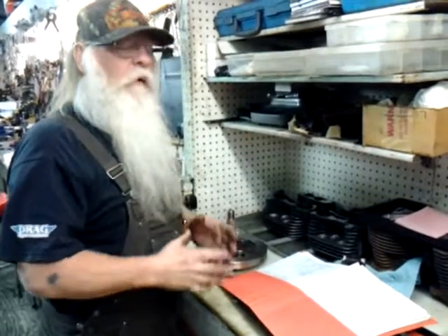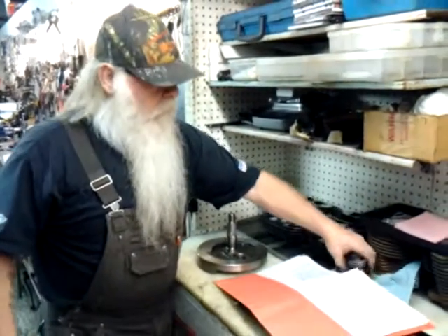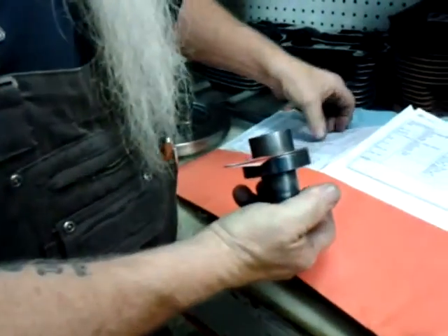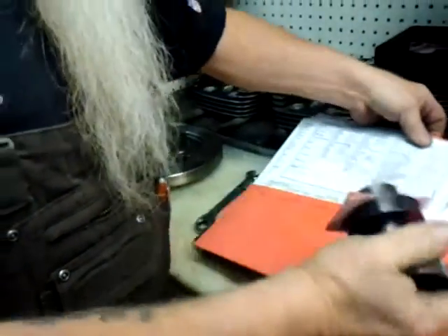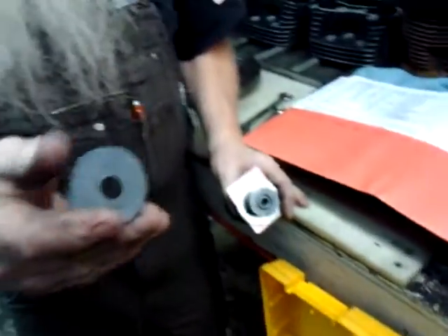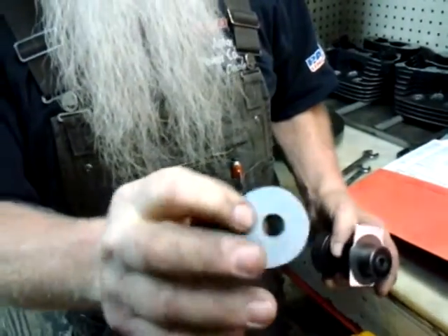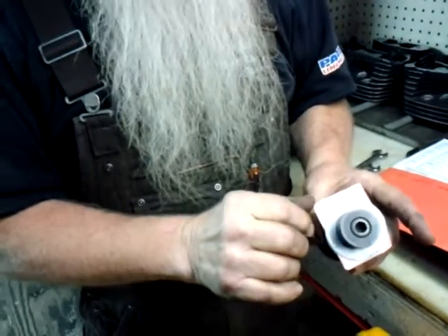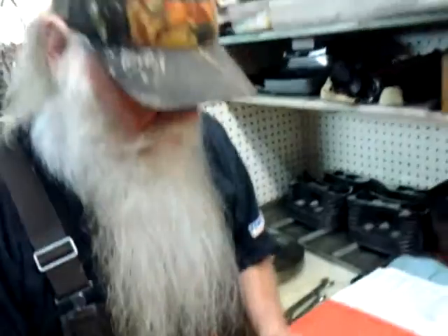When I got my bob weight numbers, I go ahead and I take this unit — it's called a bob weight — and I make it weigh exactly 1168.7 grams. And what I do, because I'm kind of finicky, is use these little shims. I went to use this one and found out it was too heavy. I cut them up and took paper and put it in there, because I want that number perfect, exact to that number.